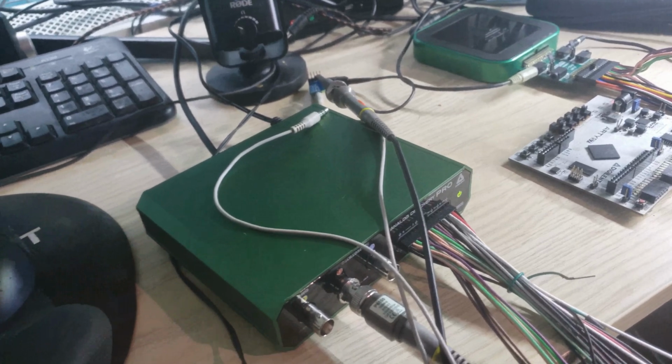Nice. And in terms of the people who would be using the Pro versus the AD3, what are we talking? And what would you need such a big memory buffer for? Yep. So we can see pros and hobbyists and everyone using an AD3 anyway for just quick and dirty measurements. You can do basically anything you want with it to start with. But when you're trying to do really more precise, repeatable tests that need to work the same way every time, capture a whole bunch of data, analyze all that data, that's where we really see the Pro coming in.